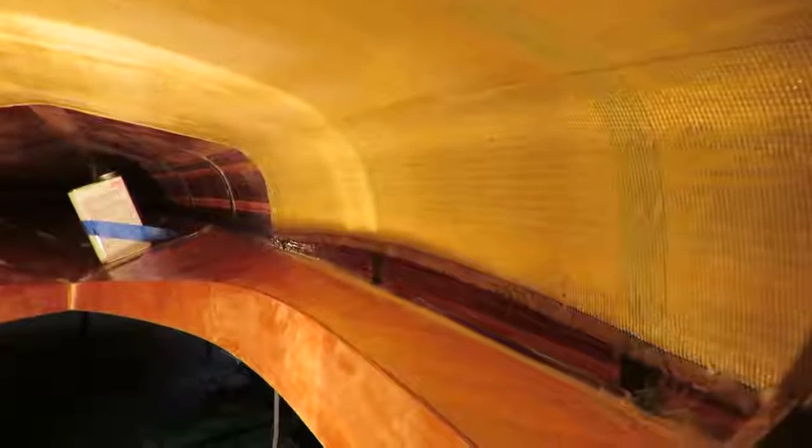And when we're talking about fillets, when we tell you how far a fillet goes with 4 marks, like when we were doing the fillets between the deck and the sides of the boat, and we said 4 marks would reach a certain distance, that's using all the spreading of the fillet and then cleaning off the edges of the fillet and reusing that extra material to go farther. Before you clean off and use the extra material, you probably only get half as far as what we were talking about, or maybe just a little bit over half as far. And then when you clean off the excess material and use that to extend the fillet further, that's when you get the full length that we were talking about.